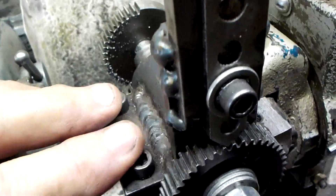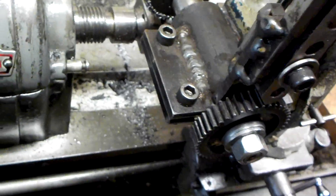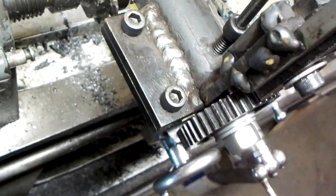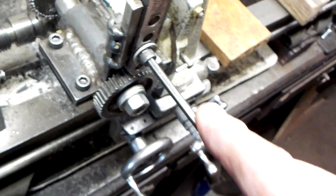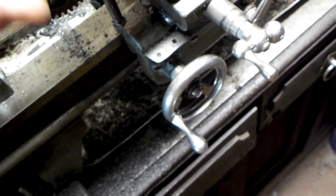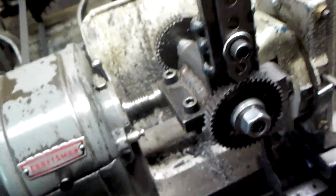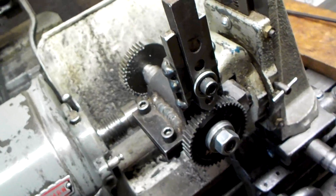Before, I was using two screws to unlock the spindle, but I've added some shim stock so that I can now rotate the spindle. This is the single screw I'm now using to unlock the spindle. I undo this screw, slide my indexing dog up enough, and — if I had two hands it would work better — I can move one tooth. Then I relock it and make another pass. Anyway, thanks for watching, have a great day.